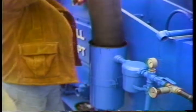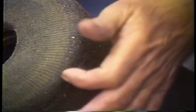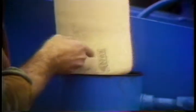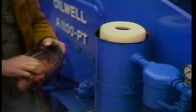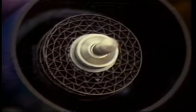Take a look at the element when you remove it. It can tell you what type of contaminants you may have in the oil and it can also indicate whether the lubricant needs to be changed at this time. Be sure you clean the case of the filter before putting the new element in. You should plan to change the filter element every two or three weeks if your pump is operating continuously, but change it sooner if the pressure at the filter indicates the need. Also clean the magnetic filter. Both filters are right next to each other and both are bypassed. Clean the case and the magnet as well as the hardware inside the case.